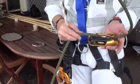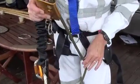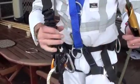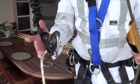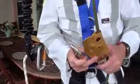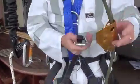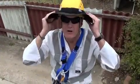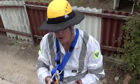And then, first example here is an ASAP. Basically, the ASAP is the backup rope. This Grillon is the working rope. Okay? Now, the fall arrestor is attached to the ASAP. So if I fell and I was upside down, the helmet would still remain on me.